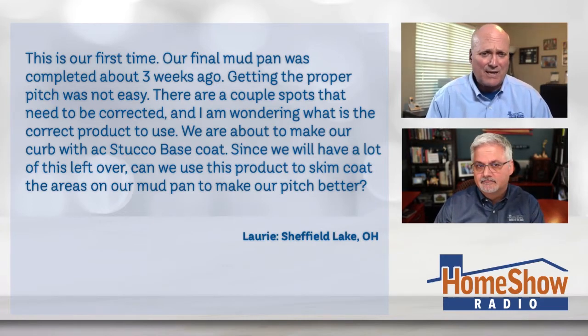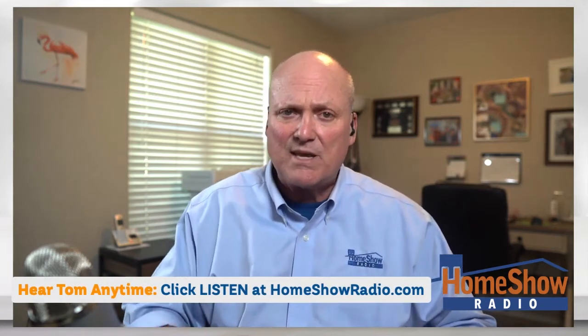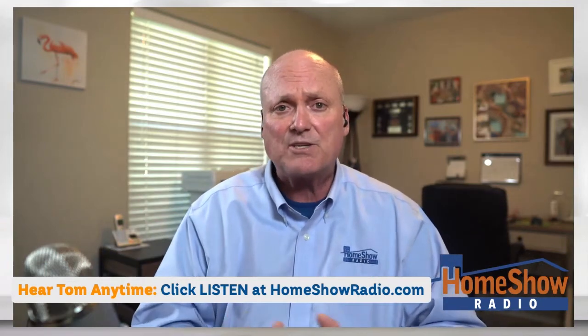I don't know if I'd use it — I guess you could. You can use a lot of different things. You could use sandcrete, vinyl concrete patch, but usually if it's a tile shower floor and you're getting ready to go into the tile phase, what you do is you mix up a little of that thinset. This way you're sure not to get an incompatible product put between the two, and at the same time you're not buying an extra product because you're going to buy the thinset anyway to set the tile.